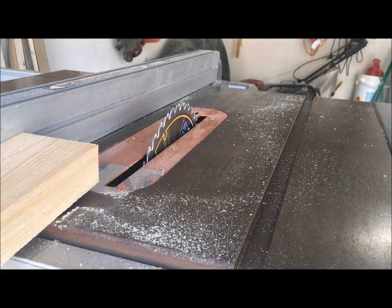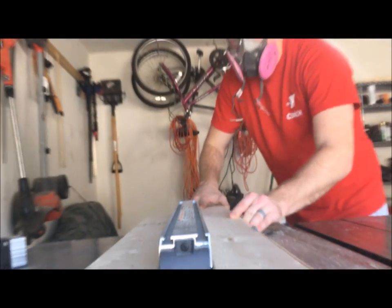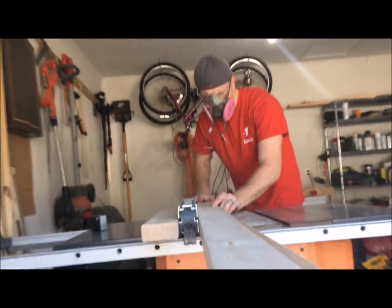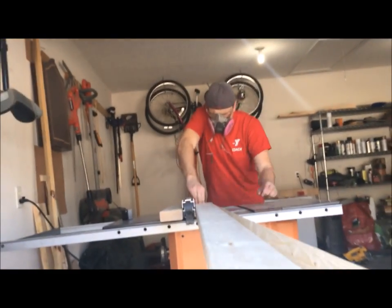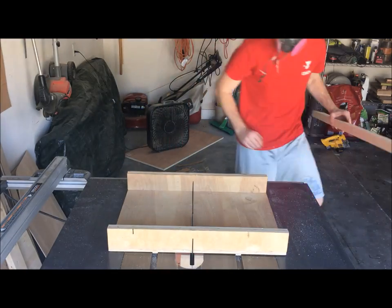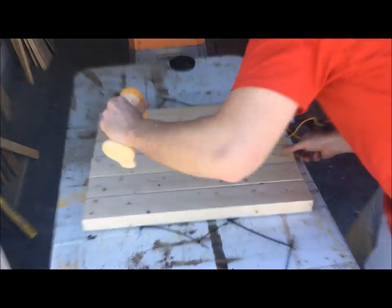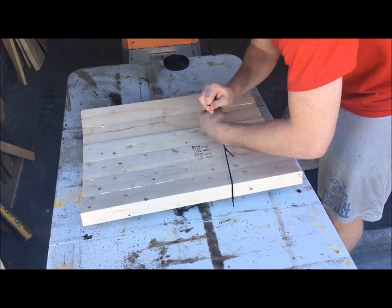It was then time to take a couple passes at the table saw, each at 3.75 degrees. One note to be careful is that these angles will not be cut parallel. I then cut the boards to final length and prepared them to glue together using some painter's tape. You can see in the video that the angles, once compressed, will create the curved effect we're looking for in our shield. I then applied glue and used some zip ties to create clamping pressure.